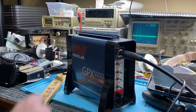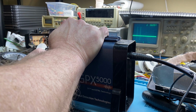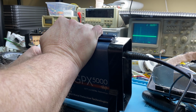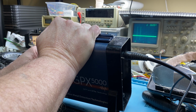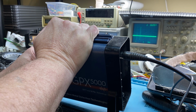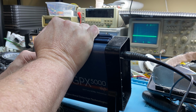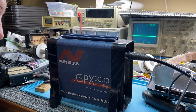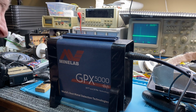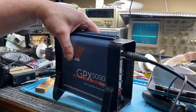Oh, I can't get rid of it on this one. I was going to say I was going to turn the variable gain down. I realise it hasn't got it, but we have got gain in the back. I'll just make sure everything's right. Yep. Manual tune. Ended up on 69. Deep. Very slow. RX gain. We'll just turn him down. Turning down to 1. There you go. Even on 1, it's still got a little bit of chirp, and I think a lot of that's from its internal electronics. Little bit of chirp there. It shouldn't be doing that on a gain of 1, but it does.